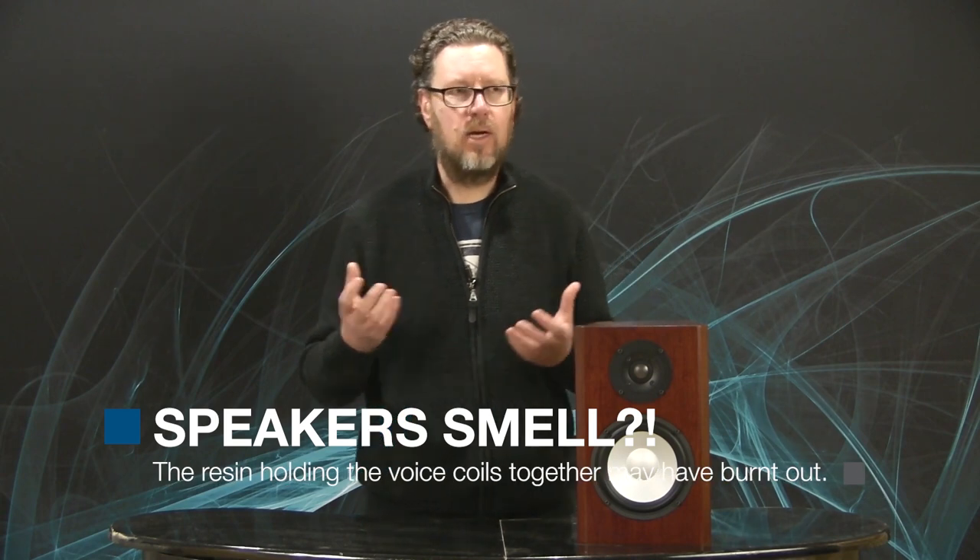The only real tool you have is to use your ears and use your common sense. Now, there is one other thing: if you really massively overdrive your speakers, you may actually start to smell something. When voice coils heat up, typically the resin used to bond the magnet wire that makes up the voice coils produces a distinct electrical smell — not really a burning smell, but like hot electronics, like something that's gotten too hot. Absolutely, if you start smelling something foreign and electronic in your listening room and you've got the tunes cranking, turn it down — you're going to break something.